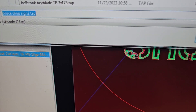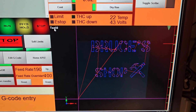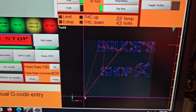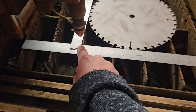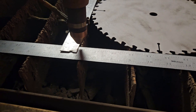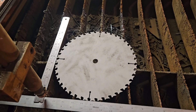I can generate the code as a G-code or TAP file. I go into Mach 3, load that code, and that shows up here without the circle. Now I have to make sure that the bottom left-hand corner lines up with where I want it to start. I set some rulers up just around the blade — this is supposed to represent where I want my 0, 0, 0 to go. I've got that lined up about as precisely as I can, and this should all be centered based on my code now.